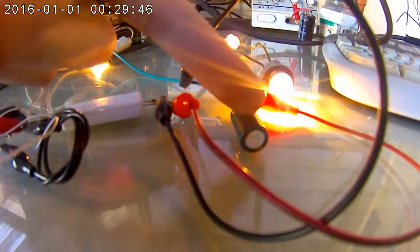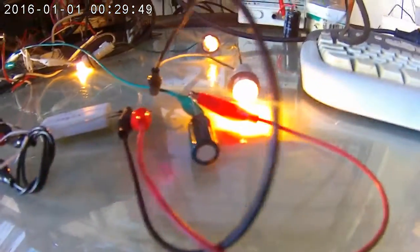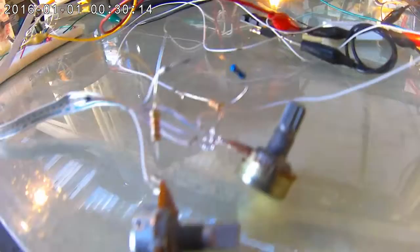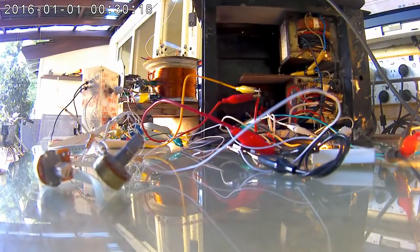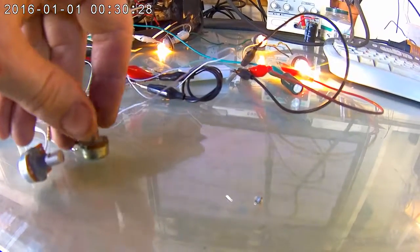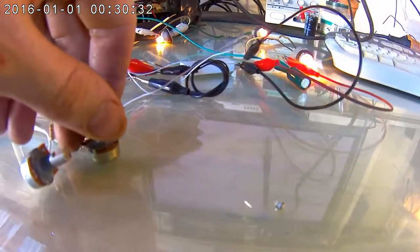The outputs will simply be placed to a capacitor each, so I've got basically two capacitors charged to about 35V — 34V. I'm using dual-gang pots so I only have to use one pot to adjust the voltage limit and current limit for both. However, I'm using two pots here because I didn't have any 1K dual-gangs, but they shall arrive shortly. The capacitors I have are a little too large, so it takes a few seconds for changes to catch up on low loads like these lamps — the potentiometer lags a little bit.